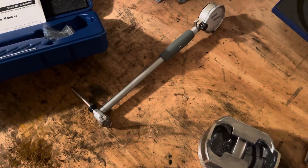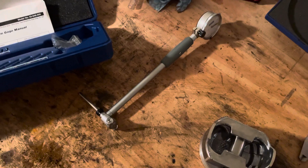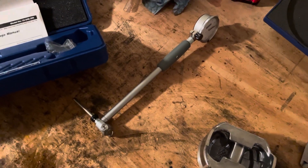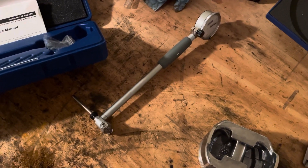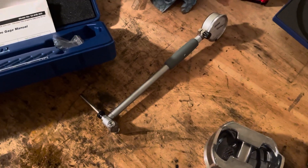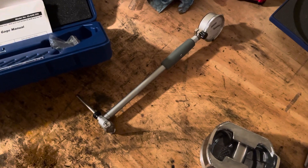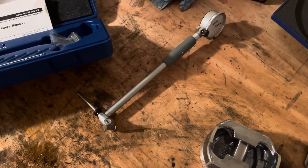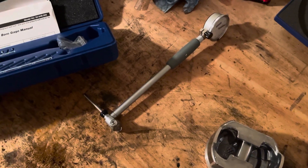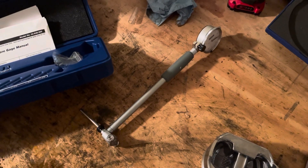I have a hunch I'll be using the 4-inch anvil for 99% of the stuff I do. That's it — I just want to explain how I use this dial bore gauge, and I love it. It's a pretty neat instrument. You can check main bearing clearances, rod clearances, and piston clearances. It goes from two inches out to six inches. It's a great tool and I have no regrets buying it at all. I hope you enjoyed my video and learned something from it — thanks for watching.